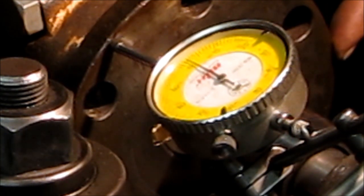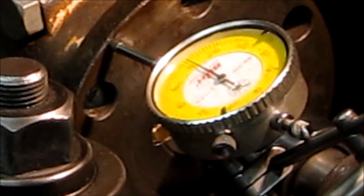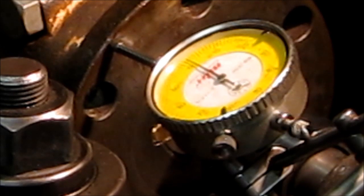This is 5 inches across here, or so. This width, every time it magnifies out here, out here, out here, you get on down in the middle of the shaft about 5 foot down, and it is that amount of times of your run out that you're trying to whip that shaft, and that will create a vibration.